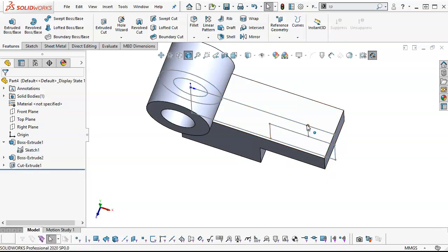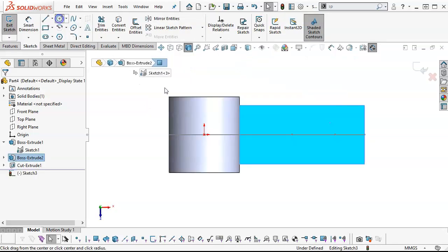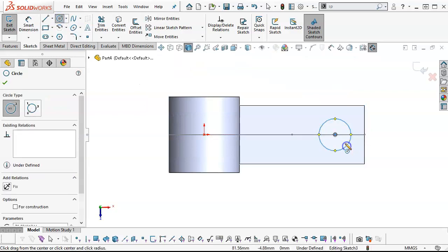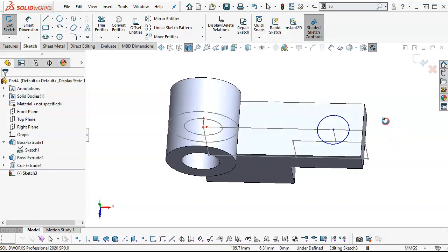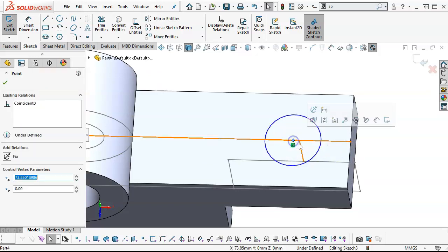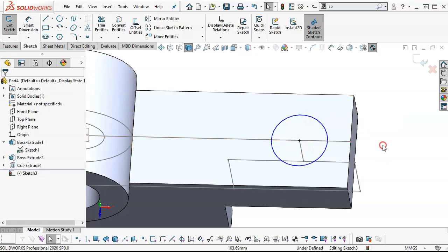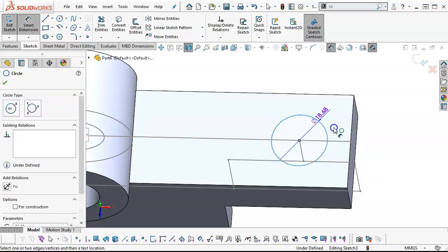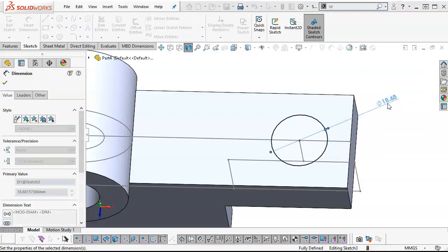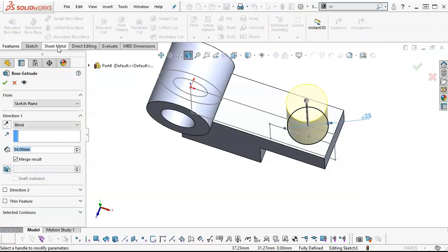So, technically that should be my center point. So if I draw the boss at that point, I'm not including a separate dimension. Problem is picking it up. So if I can't quite get that in point, then I'm going to do the control select and make coincident. Give it a diameter of 25. And then that's going to be raised up 3 millimeters.